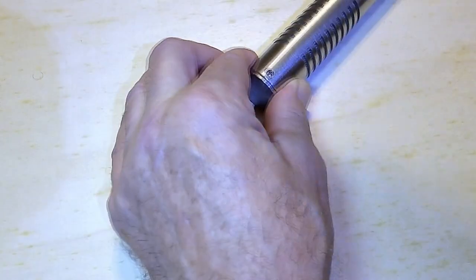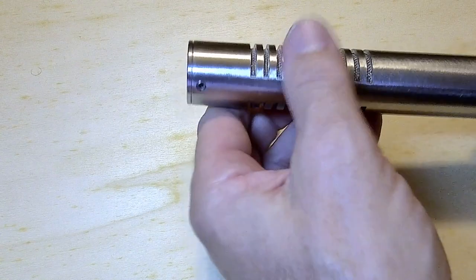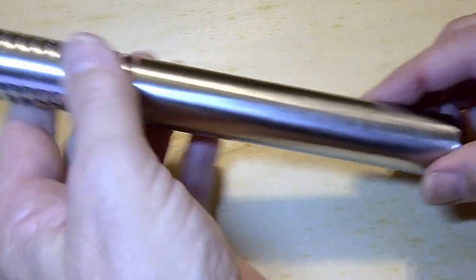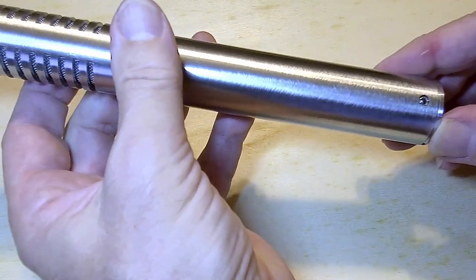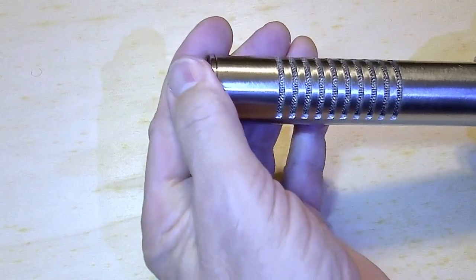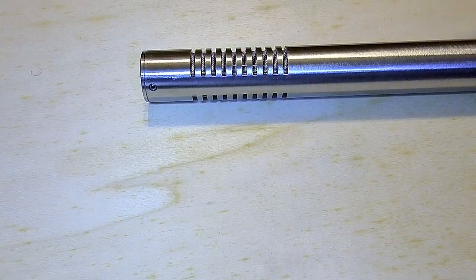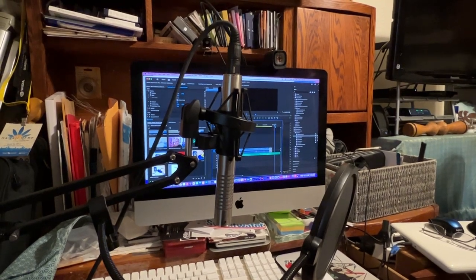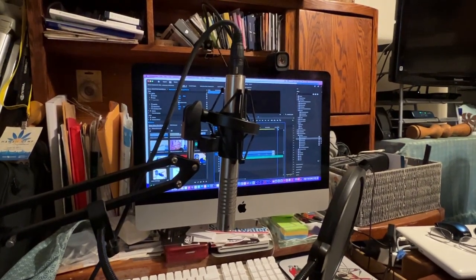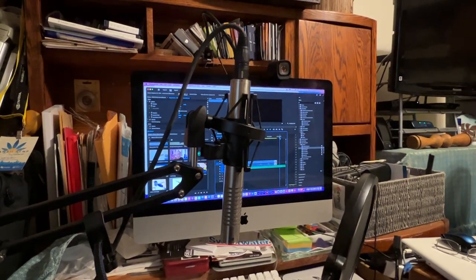Be sure to read the instructions on the BumbleBee Pro Audio website. There is important information on correct phasing, which is determining the front from the back of the microphone, and information about phantom power that you need to be aware of. As for determining the in-phase side of the mic, plug it in and record with it. You'll find out that one side sounds clear and full, while the other side, not so much. Mark the in-phase side.